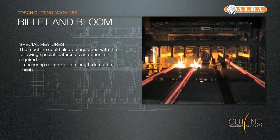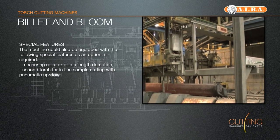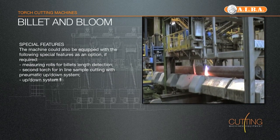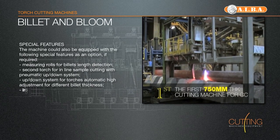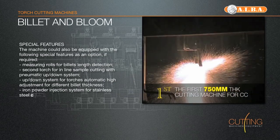Under the sequence, the cutting cars are clamped onto the strand by a pneumatic clamping device. In this way, synchronous running of the machine is guaranteed. Then the cutting cycle will start with the heating phase and cutting.